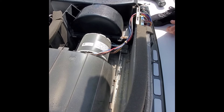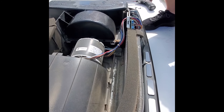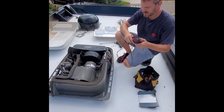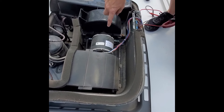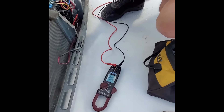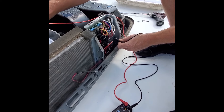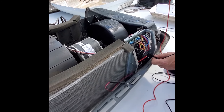That motor is super hot. I'm going to go turn the power on to it. We've restored power at the breaker box — turned the breaker back on and turned the thermostat on. You can hear the compressor is running, you can hear it groaning, but the fan is not spinning. So what we need to do is see if it's a capacitor or if the fan motor is bad — it's extremely hot, so it could be either one. I'm going to verify that I am getting voltage to the fan on high, which is our black wire. I'm getting 116 volts output to the fan but it's not starting. I manually spun it with my meter probe and now we've got the fan running. So I'm very suspect of the capacitor. We've got to take power back away and pull the capacitor out and check the fan capacitance.